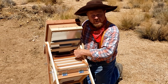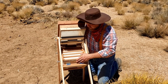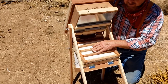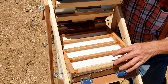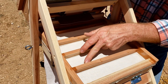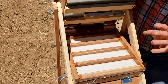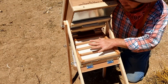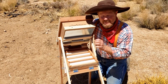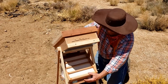The riffle board is made out of redwood just like the upper hopper and has four corresponding riffles, with a fabric material below as the air flows up through the bellows. Everything is sealed by silicone — there's a silicone dead spot amongst the riffles, and that is key to where the gold is going to trap on each individual riffle. Mike has done extensive research on how big to make these riffles and experimented to find the optimum height to trap the most gold. He's done a really good job with that.